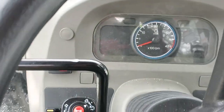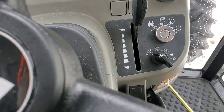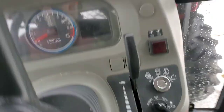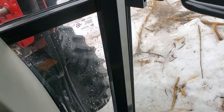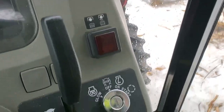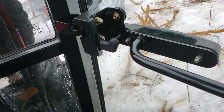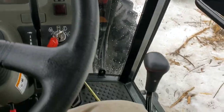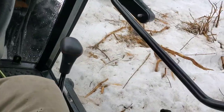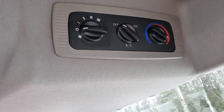The dashboard is minimalist — there's not a lot going on. For the PTO you have different selections: manual, off, auto, and then there's a red light for another on/off switch for the PTO, so lots of holes for spare switches. I might put a 12-volt outlet on the front in the coming future. It does have a glow plug mode and ignition in wintertime, including a glow plug override from the timer — although I've never needed it.